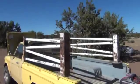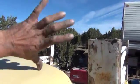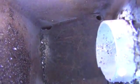I've got my second radiator done now. Those are the bedside radiators — both ready to go. I'm going to finalize the mounting on the second one, then start building our third radiator system, which is going to sit right above the cab. I'm still figuring out exactly how high. It might be sloped slightly for wind resistance. But you can see right now that's going to give us 40 feet — not including the square stock — but 40 feet of pipe to run that gas through. Because of our baffles inside, that smoke is going to have to travel through each one of those pipes all the way through to the bottom.